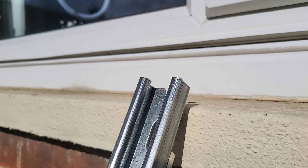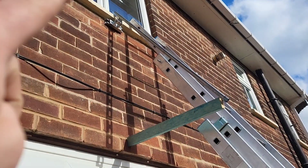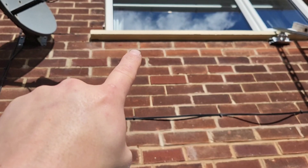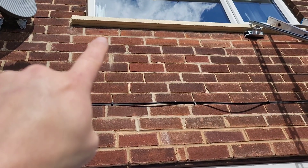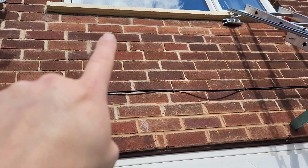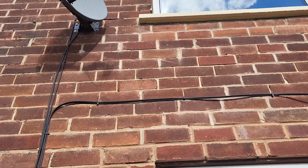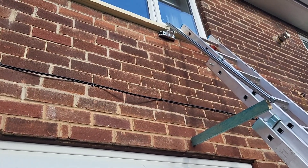The solar panel is roughly going to be here, so that's the first one done. I've just got another one to go up here — I've measured 1100 millimeters from there to there, which gives me a 300 millimeter overlap on my panel either side. Obviously that sky dish needs to come down and taken away because it'll cast a shadow on my panels, but I'm happy with progress so far.